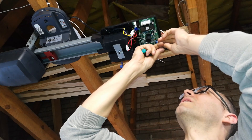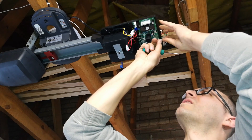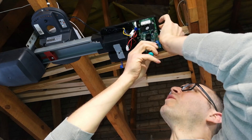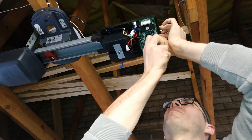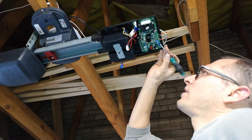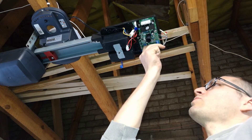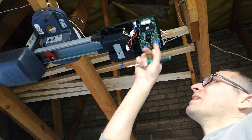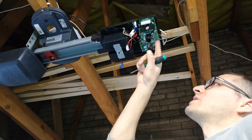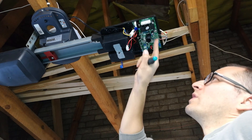The last wire tells the controller that a safety beam is present. On the X-Track it connects to SP4, and there is also an SP2 for a second safety beam. Importantly, on the X-Track there is a dip switch labelled 'safety beam' that you must also adjust so that the controller board knows the feature is active. Your controller may have a dip switch or jumper to enable this.